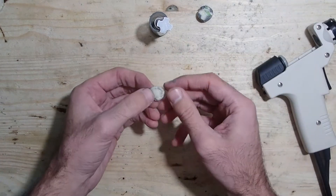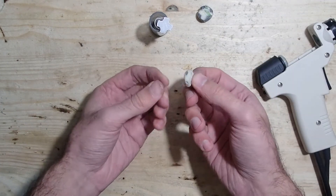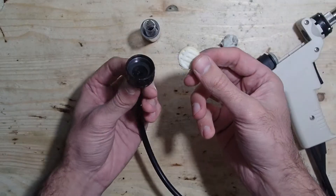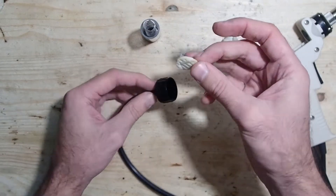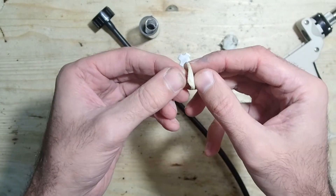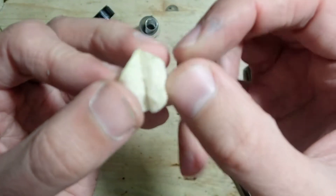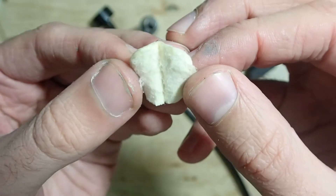The next point is that the felt filters suck up the flux and after a while no air can pass anymore. You have to replace the filters regularly. There are two filters used — one in the handgun and one in the desoldering station itself. The manufacturer supplied only two sets of filters and they get dirty quite fast. Unfortunately, the filters are really expensive, costing between 7 and 10 euro per set.